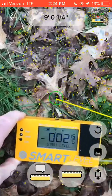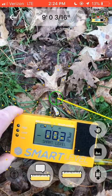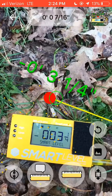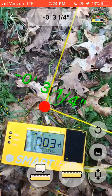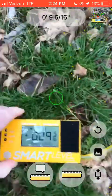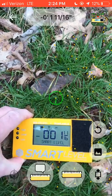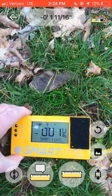Now I'm going to clip it on the left hand side. That just closed our perimeter. I'm going to take a couple of interior points. Although the yellow line is no longer here, the level is still recording where we are — it still knows our X, Y, and our Z. You'll see this in just a minute.